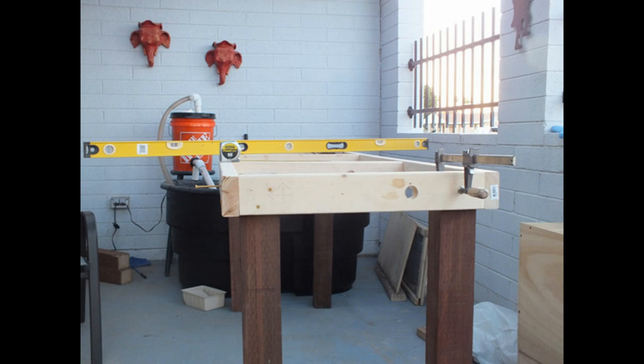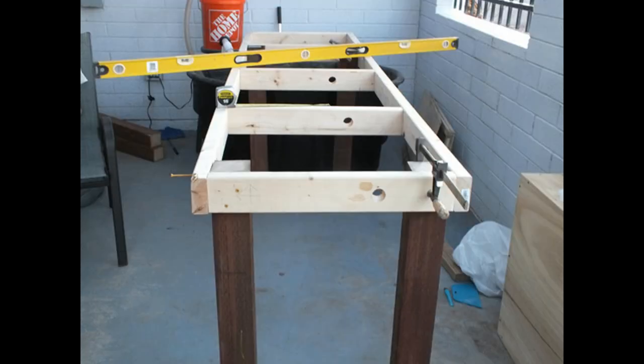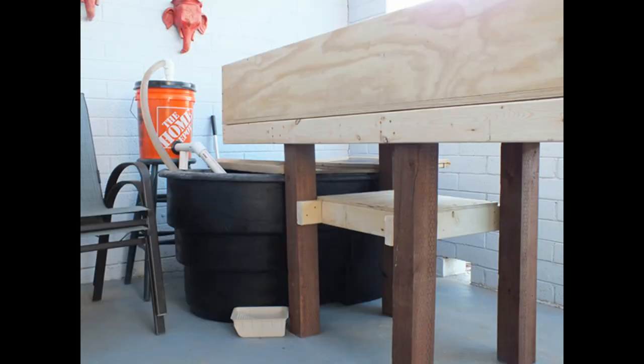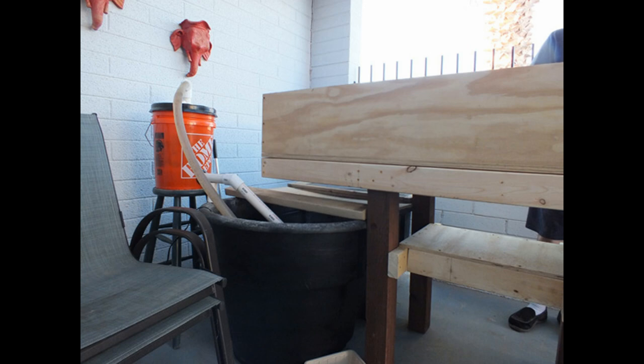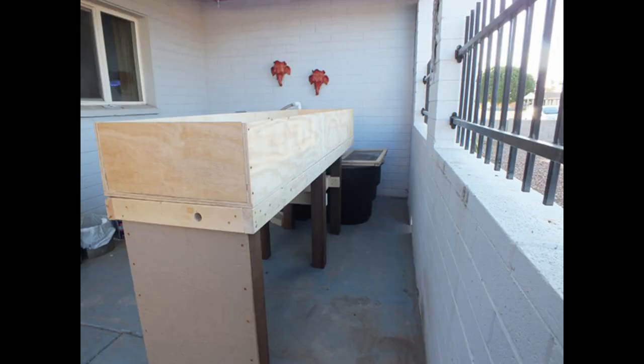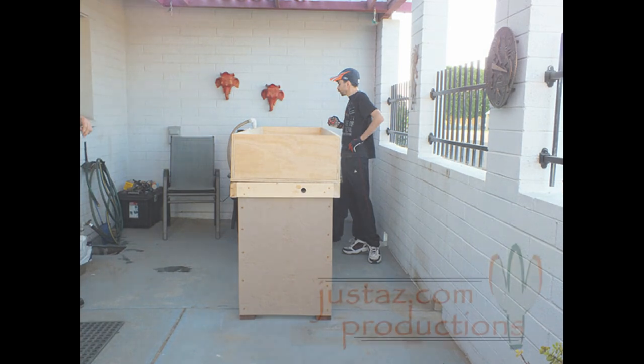The basic construction is a rectangular box on a stand. The holes you see line up on the frame, and the supports are for the plumbing. In the previous design, the plumbing between the beds and the pond was a confusion of piping. The new plumbing will be streamlined and supported, making it cleaner and easier for repairs if needed. One end of the bed cantilevers over the fish pond. I'll put a bell siphon and the weep hole on this end, and the fill pipe on the other. With just one bed, we can move the system out into the space. This provides easy access for the grow bed and the pond, takes up less floor space, and still provides about the same amount of grow space as the two separate beds did.